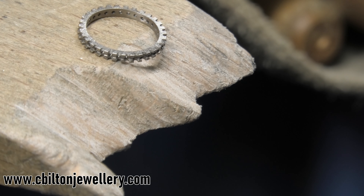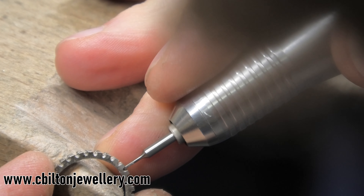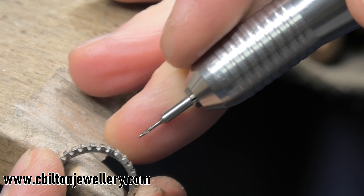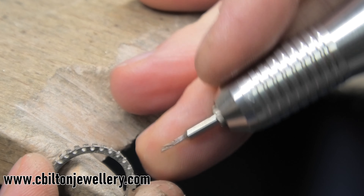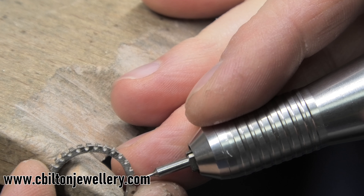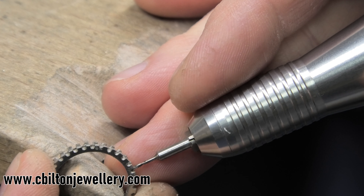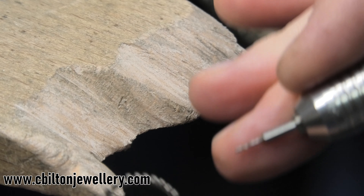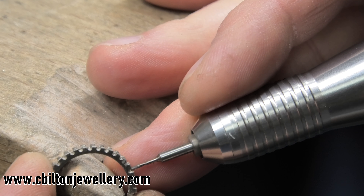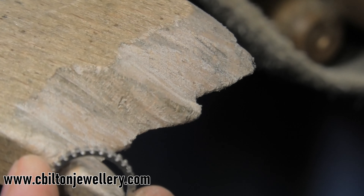Oil up the drill, using the same tools I used to make it, same techniques — drilling straight down through the center. I'm just going to go around it; don't need quite as much care as before. Keep in mind where you started — you can mark it with a pen if you want to be really confident about it. These holes are really open on this casting. Sometimes you'll get a hole that's completely blocked up if they were quite fine holes, and it's like investment or something from the casting.